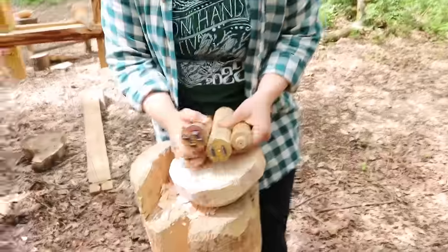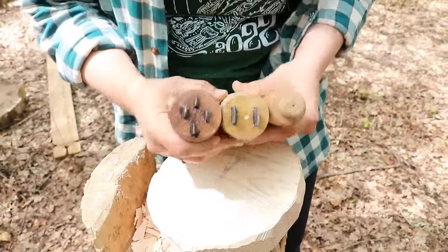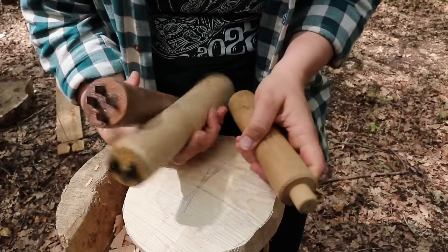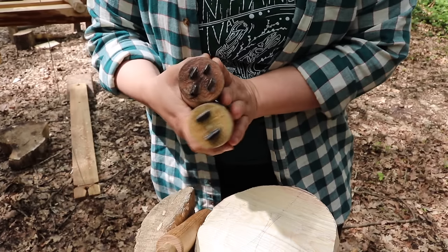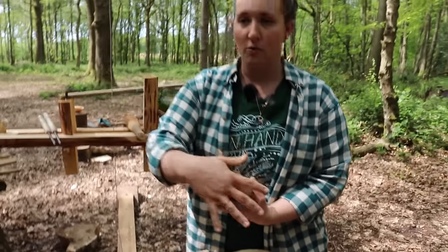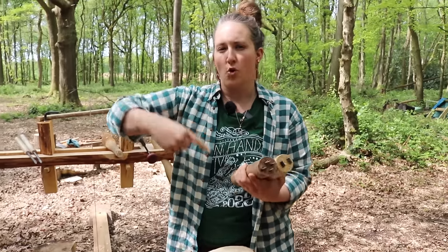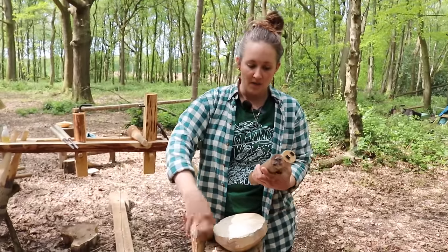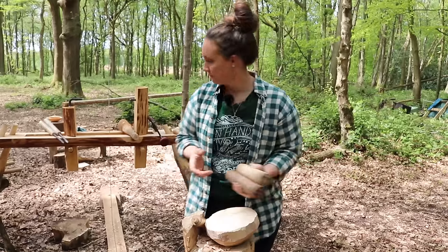So with the spike mandrel, maybe you'll do a whole mandrel video at some point of different ways that you can make them. But today we're going to use the tenon mandrel. I just wanted to show these as an example. These could be very useful for a sizable bowl, but it's really good for things like plates with a very large diameter because the torque has a higher potential that the mandrel rotates within the piece of wood. And when you have spikes, it can't rotate anywhere.